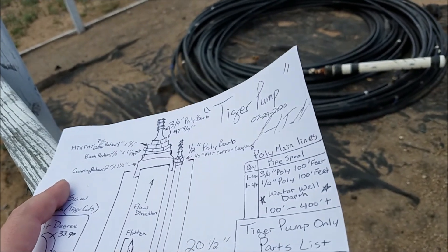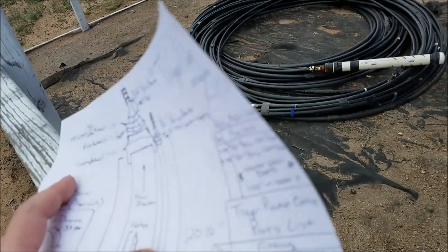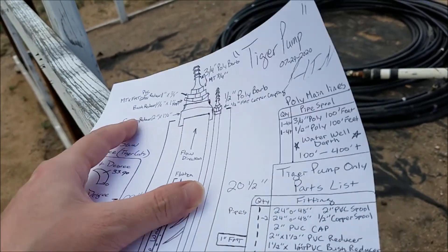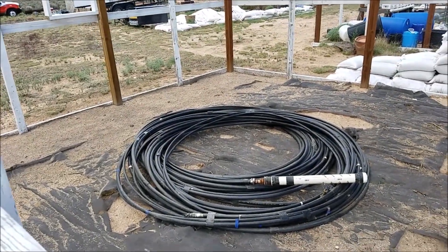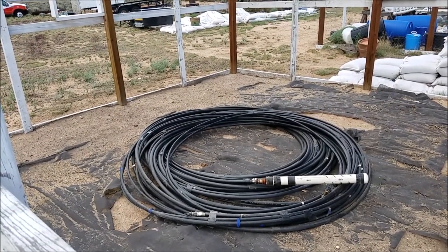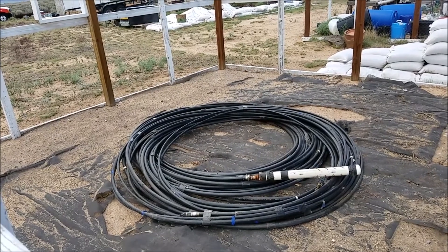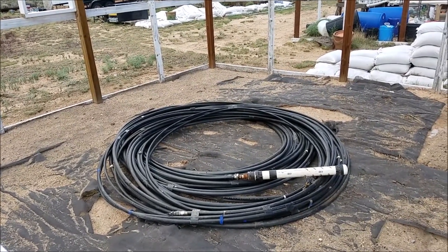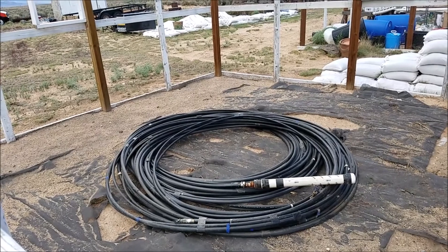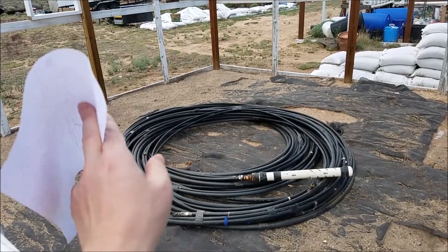Once you get to the bottom of your water well, I recommend dropping it as far down as you can go but not all the way to the bottom — just enough to start on top of the mud, then work your way down as far as you can to bump earth into the nozzle, letting it fall in and be sucked in by the bubbles and pushed out. This is based on the air lift pump design from about 100 years ago, originally by a German inventor.